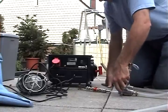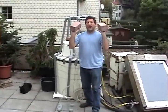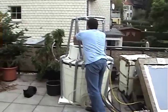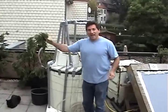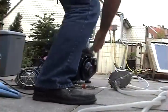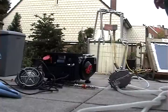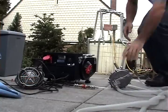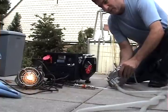I guess if I didn't use the regulator at all, it might work as well. Then we put two larger bricks on — these are each 4.5 kilograms, so an extra nine. We found that when you have 23 to 24 kilograms — about what the airlines will let you put in a suitcase without paying overweight — that's about the pressure you need to run a biogas system. Now, that's without pressing the primer, and it's staying lit. Obviously, when I hold the primer down, six bricks pressure is good.